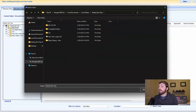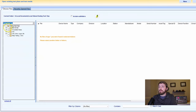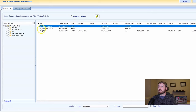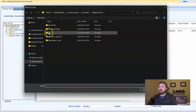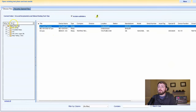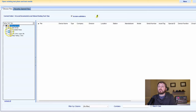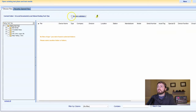For me, it's called 'Testing Tech Tips.' We select that folder and you get a tree in Protection Suite. With 'include all subfolders' checked, here's my IAC and here's my BE1 — I have those two PSX folders. If you navigate to the folder directly, you can't see the files. When you go back to your main projects folder and select it, you can then select a project or substation or maintenance cycle from the menu tree. Once you get used to it, it's not too bad. If you uncheck 'include subfolders,' you have to navigate to the individual folder.